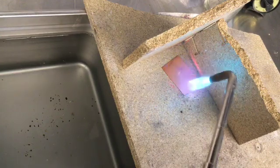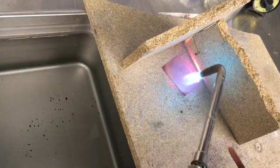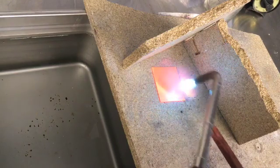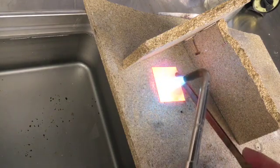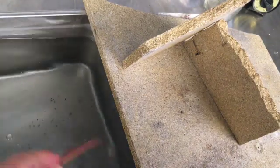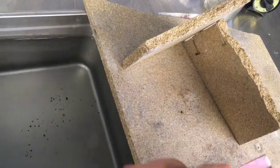Pickle and degrease your metal. Set up a clean fire brick or soldering pad over the edge of a quenching pan like the deck of a swimming pool. Lay your piece on the brick and surround it with other bricks — this will help it heat up faster and help keep oxygen away. Heat it using a torch large enough to engulf the piece; the flame helps keep oxygen from getting to the piece. Nuke it until it glows a bright yellow-orange. Keep the torch on it while you pick it up with copper tongs or nudge it into the water. Turn off the torch. Fish your piece out of the quench and rub it clean with your fingers in running water. If you like what you got, you're done. If not, pickle, scrub, and try again — it's easy to repeat this process.